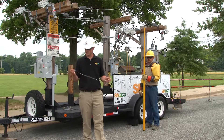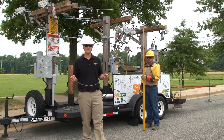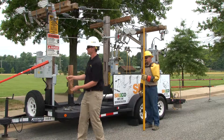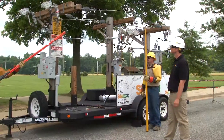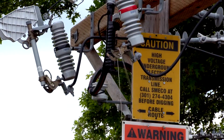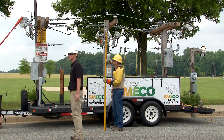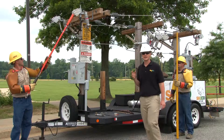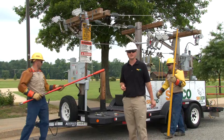If you have little kids or you're an adult who likes to fly kites, please look up first. Make sure there are no overhead power lines. Doug's going to demonstrate whether or not this kite string will actually feed electricity through it. It doesn't even sizzle. So unfortunately, if you were flying a kite and that kite went into an overhead conductor, electricity came down that kite string, through your body, through your feet, into the ground — you are the easiest path to ground.